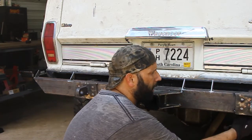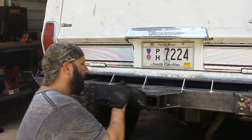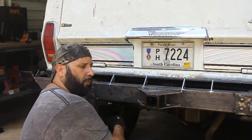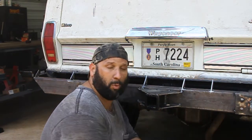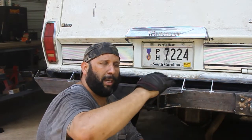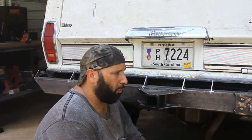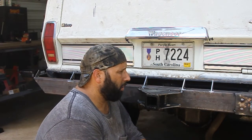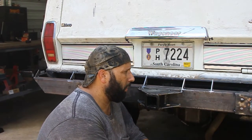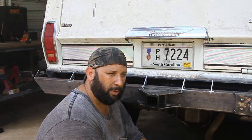The other thing is, on the bottom side of the bumper, it's going to get tabs that tie into the bumper and bolt to the bottom of the frame. But I'll go ahead and measure that, because I have to do the bottom weld on the bumper first, grind it, and then put the plate on there, and I'll measure what I need as far as those go for the underneath, and pre-drill the holes, so that way it's all good to go. But at this point, because this is more cosmetic, I'm going to go ahead and weld out everything and keep this party going.